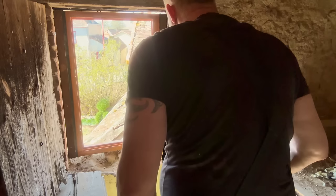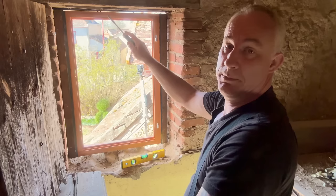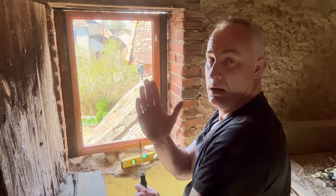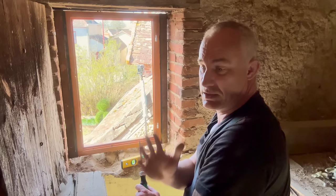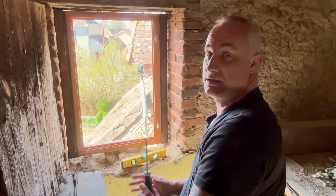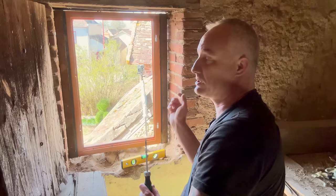The window is now hanging free, just suspended in the air by those two screws in the top which are screwed into the wooden lintel. There are no forces on the frame. I'm going to secure it in a straight vertical line so that the window doesn't swing open and fall closed, but that's about it. I'm not going to put it under any more stress, then seal it off on the edges and let the sealant cure.